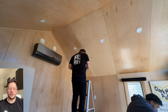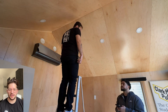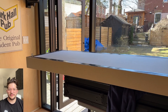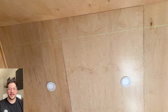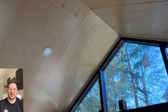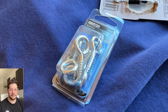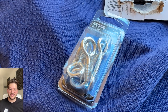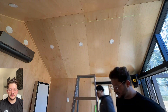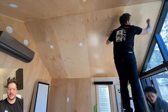Once the eyelet screws are all in, we do our layout on the ceiling, centering the panels in between the pot lights. There's a little variance between each section of pot lights, so we do all measurements first and center left and right on the ceiling. I set up my laser line so all of the upper mounting points run along that line. That ended up being eight inches off the top center mark — and since our panel hardware is four inches from each side, the panels will sit right in between that slanted roof section. I get the entire upper section done first before matching measurements on the lower section.